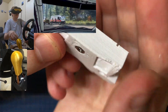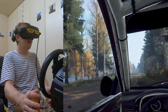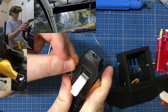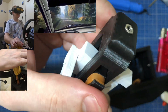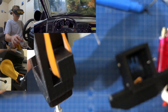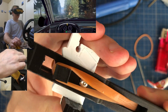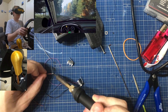This is the central hinge part. I'm using embedded nuts like this — I heat them up and push them in, and that makes for a really nice smooth connection. You tension it with a rubber band. And here I'm installing the long bolt for the gates. You can see how it has two springs — one of them is hidden inside for up and down motion.